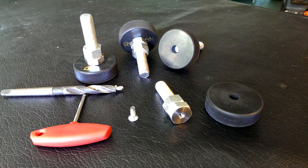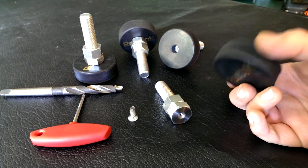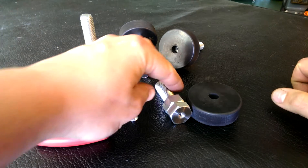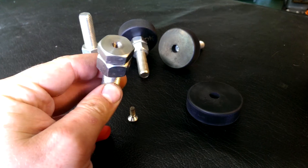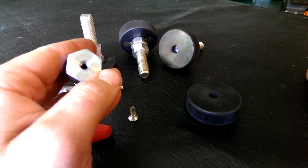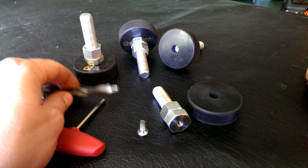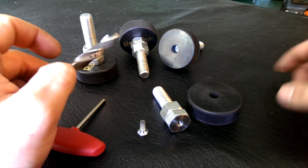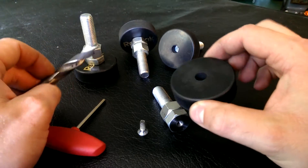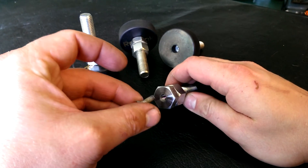You can do this as well and save quite a bit of money. You just buy the small sized hockey puck. You take the leveling screw — in this case for my surface plate — and drill and tap for a small screw. You use a step drill to make a hole, and just fasten the screw with some Loctite.